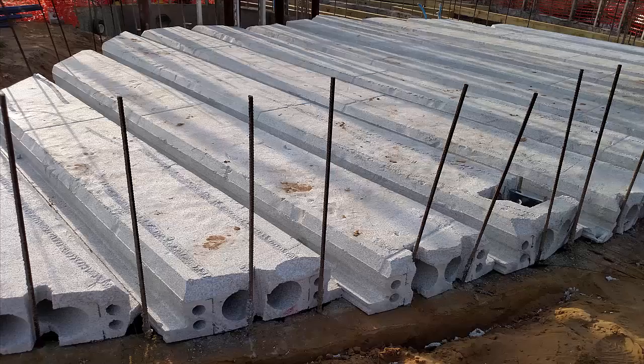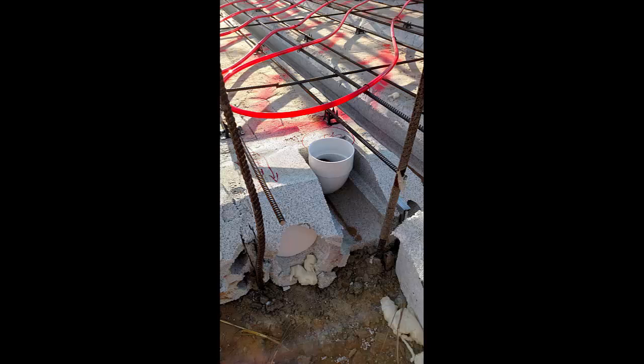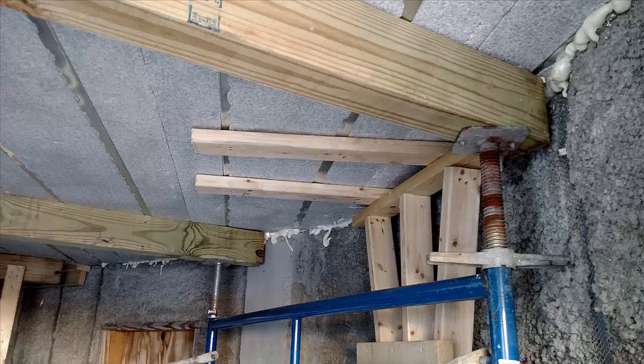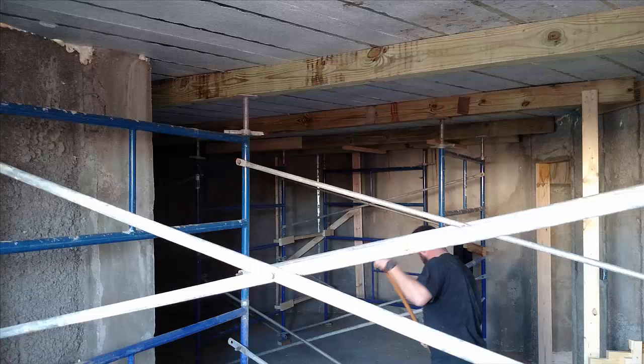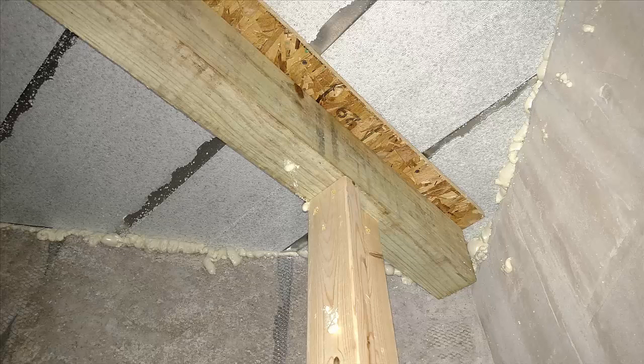Here are some photos. At the end of day two, you can see the deck is barely resting on the wall — this is so the concrete will sit as wide as possible on the wall. A surprise for me was that I still needed to build the formwork around the perimeter to keep the concrete in — apparently that wasn't included in the quote. A ventilation duct was placed while the crew was at lunch on day three. From underneath, you can see they braced any planks extending beyond the shoring to prevent the concrete from pushing those ends down. Nine cans of spray foam were used to fill in the small gaps and prevent leaks. We'll finish setup and pour the concrete in a separate video.